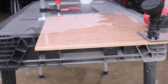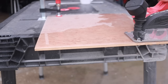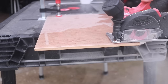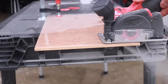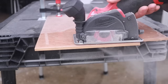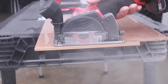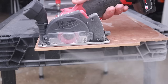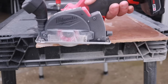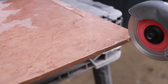Let's cut some tile here real quick. While we're doing this, I'll give you some stats on the weight and size. This is not for a very big job — if you need to make some precise cuts, like cutting tile to get around a door jamb, this is perfect for that. You don't need that large tile saw; just take this out and add some water. As for size, this is a very small saw: 7.1 inches in length, 4.7 inches wide, 3.2 inches in height, and it only weighs 1.5 pounds without the battery.